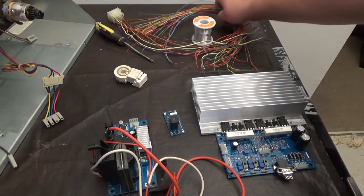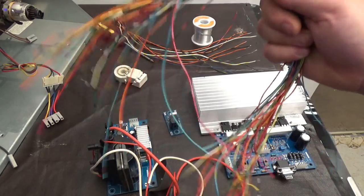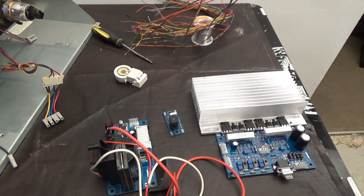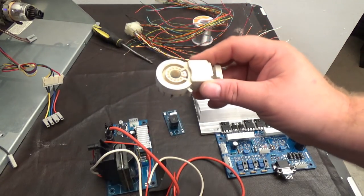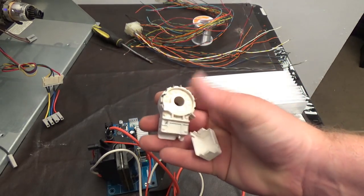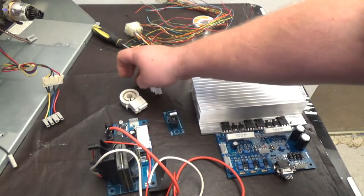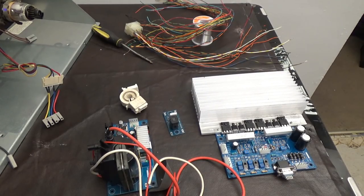There are a few things you're going to have to source on your own. I'm going to have to use various lengths of wire. You're going to need a Molex connector that plugs into an Atari, and you're going to need a connector for your tube. This can be found on just about any TV set — I desoldered it from the neck board from an old TV set.